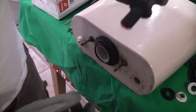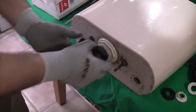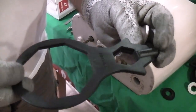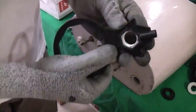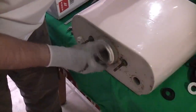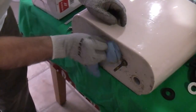This one needs to be set at about that position. I'm now going to remove the rubber seal. With the Jolly Tronic kit you actually get a plastic spanner — to be honest it doesn't look much good — but we'll see if we can undo that. And it has actually undone it, so you do actually get that with it which works surprisingly well. That part fits on the flange nut and then the larger part obviously fits on the big nut in the centre. We're just going to unscrew that and then pull that out, and then give that a wipe with some blue towels on the inside too.